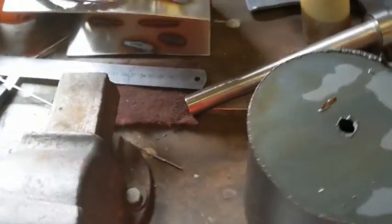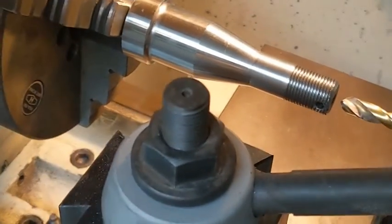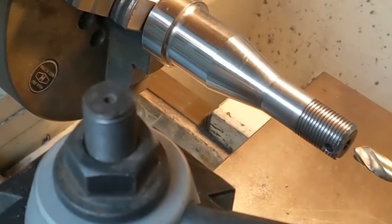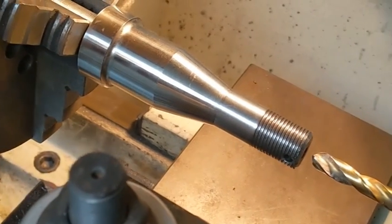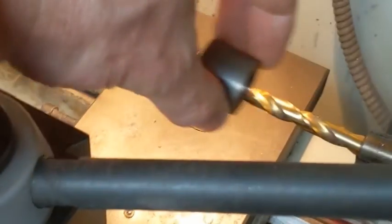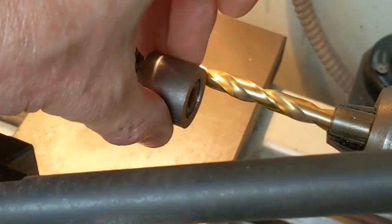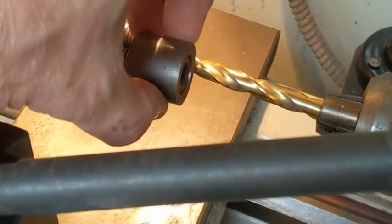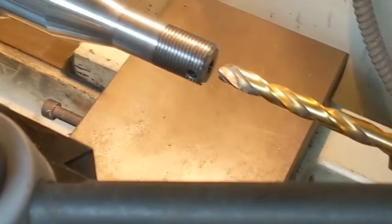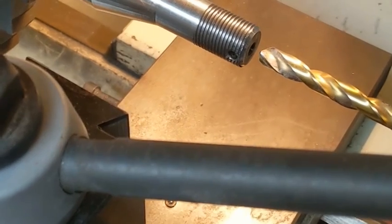The piece will fit on the end — that's the cap. Doing a little bit of work here on the axle that supports the center of the bike. There's a bolt that bolts into the end of the axle, and there's a cover plate that screws into the end. Welded onto this is the support that runs parallel to the frame. We'll get a 9mm hole drilled in this and then tap it out with a thread to 10mm.